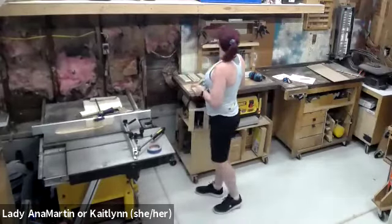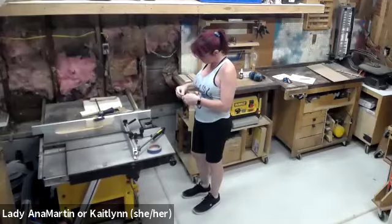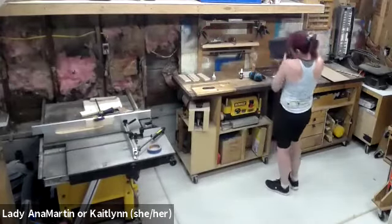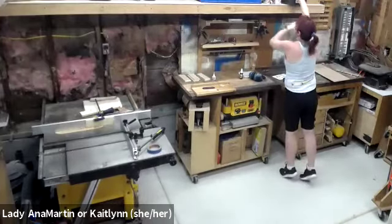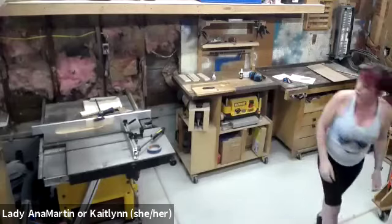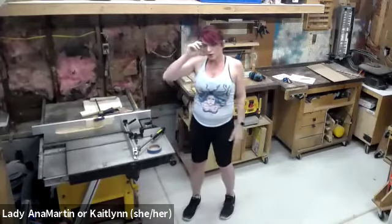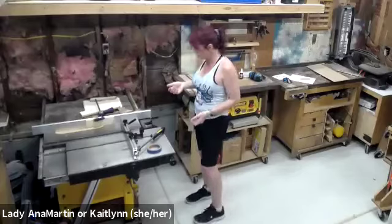So some of the joinery that we use in the SDA, and I do not recommend, are not in that box, like I thought they were. That's really strange. I thought they were in there. Angle brackets, metal L-shaped brackets, these screw to both sides. They're never going to be square. They're never going to be very strong. Those are great for construction. They're terrible for what we're doing.